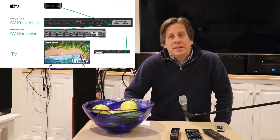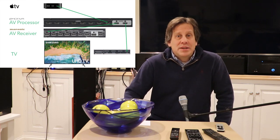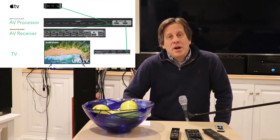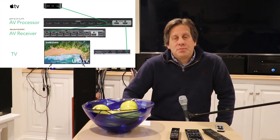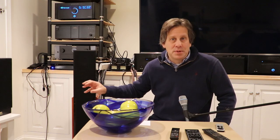The problem is we haven't been able to get it to work in that direction. We can see video from the RMC1, but we're not getting audio received by the Marantz receiver. So we tried it the other way around and had success. We take the Apple TV HDMI out to the Cinema 50, and then from the Zone 2 output of the Marantz specifically, we bring that to the RMC1. The monitor output only gives us video, not audio — the only success we had was coming out Zone 2.